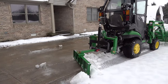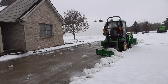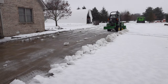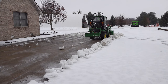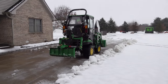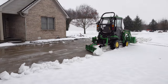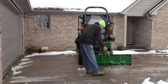Another disadvantage a rear blade has if you're working with a bigger snowfall is that it can push snow up under the tractor. You can see it a little bit here - you can get that pile of snow up under your tractor to where you can't even get traction, because your tractor is what we'd call high-centered, meaning the pile of snow is keeping the tractor off the ground. That'll help exaggerate the point of the snow pile in the middle of the tractor.